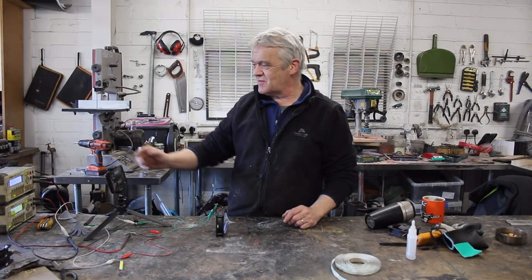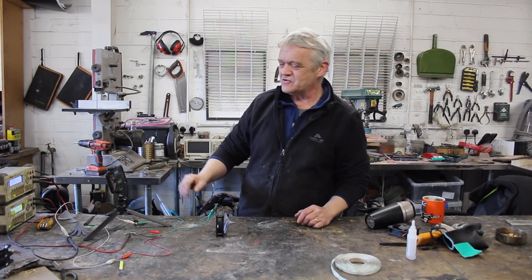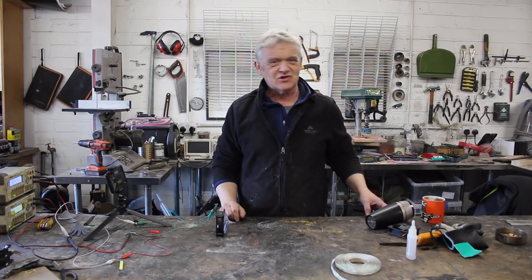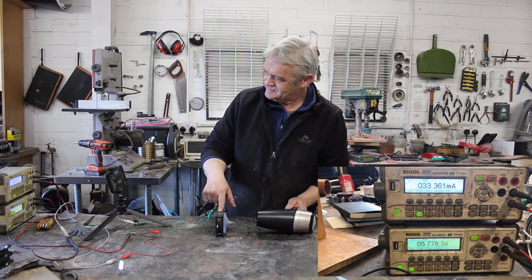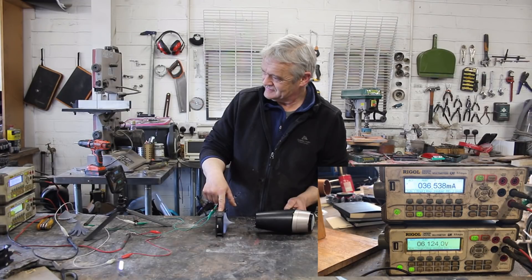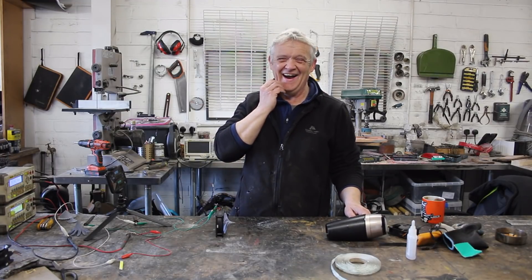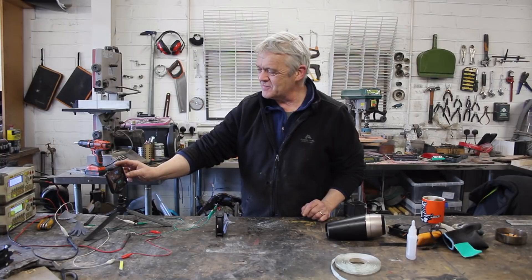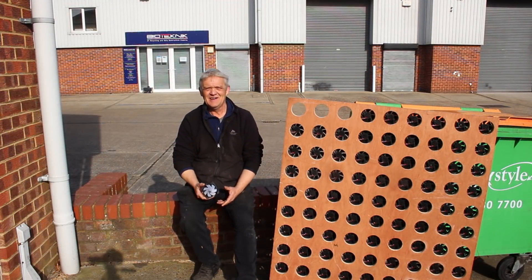Everything is set up with two meters recording amps and volts at the same time, wired up in series parallel, reading volts and milliamps. The wind source is a hairdryer. The result is roundabout six volts and 33 milliamps — something like that — giving us 210 milliwatts out of a single unit.